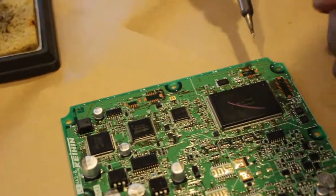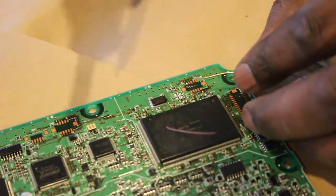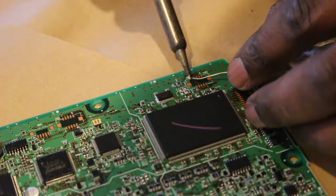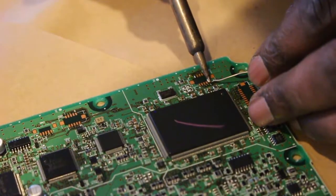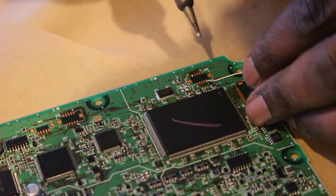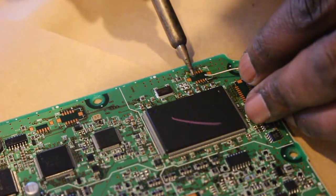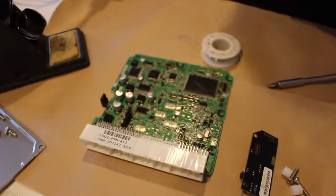Right here I usually put solder on one of the first traces first. I put a little solder on it so that once I'm ready to install, I have a nice location there — it helps keep the header in the correct spot. I started off with both of them from opposite sides. There you can see the two little pads of solder I put on.